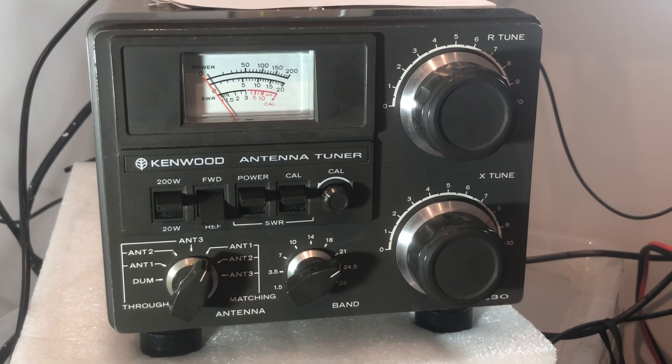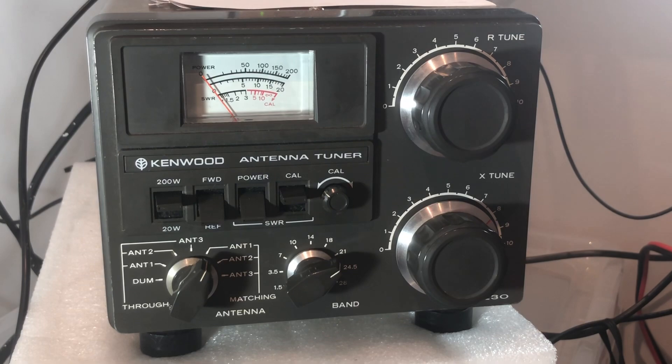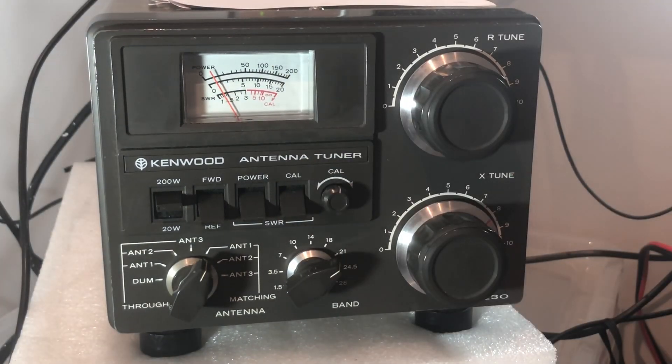So that's it. The last thing we can do is check the SWR on the tuner. Some tuners will have this facility, some won't — and you can also have an external SWR meter in line. I'm going to click from power down to SWR, calibrate, and then check. As you can see, a very acceptable SWR reading — I've got nothing on the Icom Sentinel 300, and about 1.3 to 1 on the tuner. With very little reflected power, I think that's pretty much successfully matched the antenna and the radio together for this particular band.